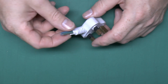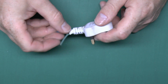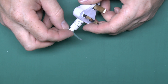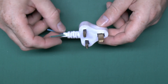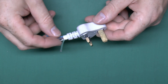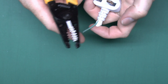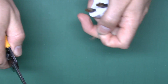This is the plug from that horrendous adapter. I've just removed some of the white covering, which came off very easily. It appeared before that the green conductor was not connected to the earth pin, which was a huge fail. But having thought about it more, it might be that the conductor was connected but the resistance was so high it showed as basically infinity on the meter. The meter only goes up to about 5 ohms, and that small section of wire measured at about 2 ohms, so the total resistance could be in the 5-plus range. So I thought an easy way to check would be to strip a bit of the wire and measure from here to the earth pin with a multimeter, which can measure considerably above 5 ohms.